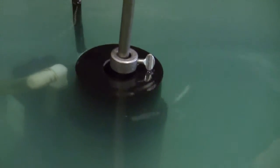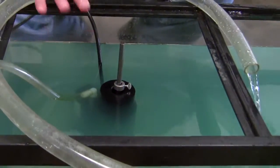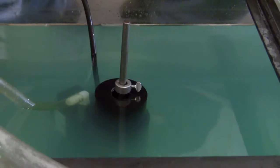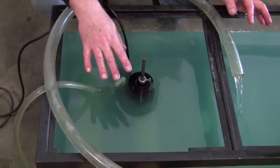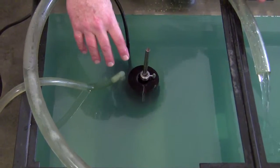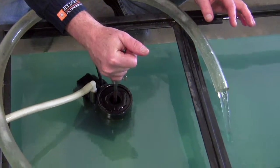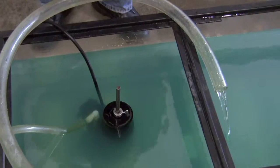What's nice about this skimmer is it will pull from a 360-degree arc — if you have oil on the surface, it's going to get it off really fast. Once the surface oil is gone, it'll start working on the coolant with oils that are mechanically mixed in from pumping and splashing. You want as much space as possible to allow the skimmer to follow the coolant level, because over time the level in the sump drops due to evaporation and carry-off. You don't want this thing sucking air — that's not good for the pump and it won't last long that way. Make sure it's in the liquid all the time, and once you do that, you're good to go.